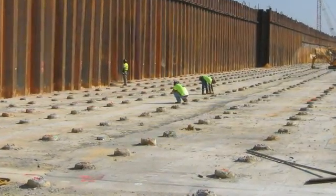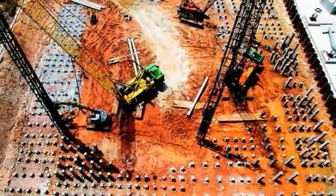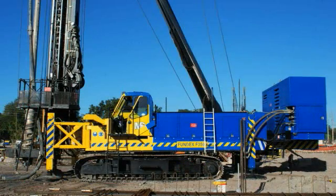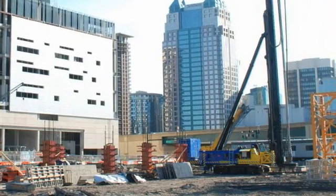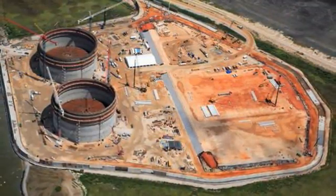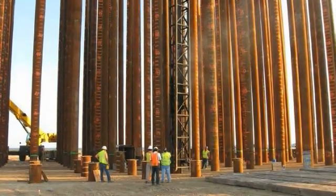Furthermore, the start of a project is not contingent upon mill rolling dates or pre-cast manufacturer limitations. When compared to auger-cast piles, DeWall piles provide a higher quality end product and a much cleaner and safer job site by the elimination of spoils. DeWall piles are generally less expensive than auger-cast because they are installed faster, have much less concrete overconsumption issues, no spoils to dispose of, and they achieve the same working load at shorter lengths or smaller diameters due to the soil densification characteristics of the system. Morris Shea Bridge Company is a uniquely qualified specialty foundation contractor capable of installing DeWall displacement piles as well as many other types of driven and drilled piles, micropiles, and drilled shafts.